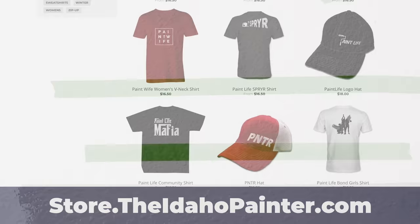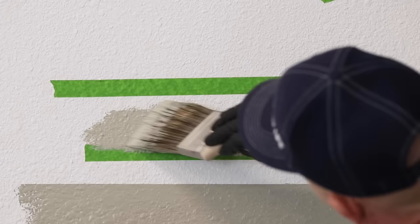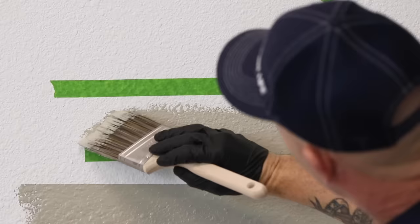Now I'm going to paint over that line. Even with the caulking, one of the things I teach my guys is when you're brushing over your tape, don't put a whole lot of pressure — just use finesse. Press lightly, get your paint on there, and press lightly. Don't work it in really hard down into the grooves, because you'll push paint onto the caulking and could force it — and your paint — under the tape.